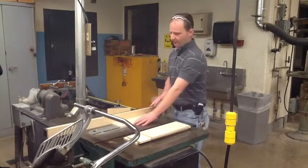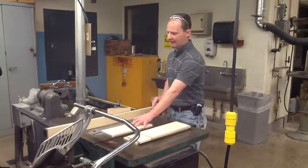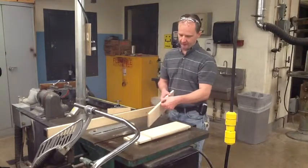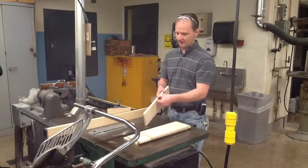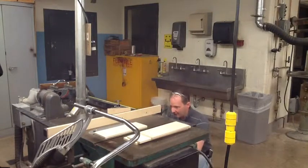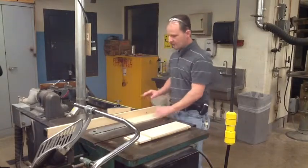Okay? So, I have my 1/2 inch. I need to adjust my blade height to a 1/4 inch. With the plywood, the easiest way to do that, since we're going half the thickness, is to put the blade height in that middle layer and just center it. So I will go ahead and verify that. And it looks like we're actually pretty good from last hour. Okay.